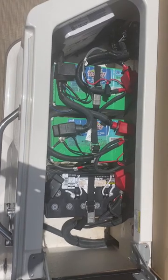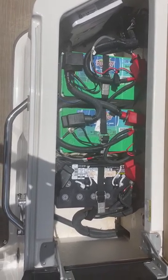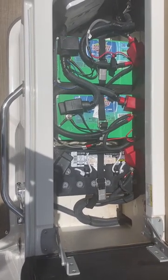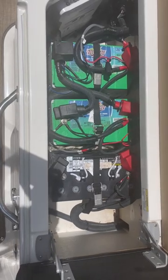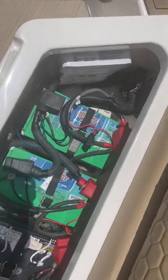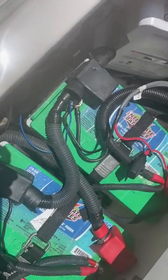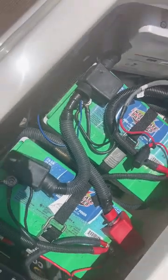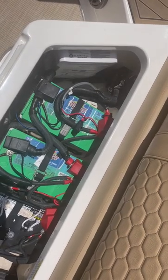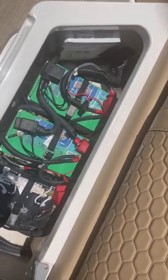Battery compartment. As you can see, there are three batteries: the starting battery for each engine and then the house battery, which controls everything else — the stereo system, the lights, the whole works. Also in here is the battery charger — it is a Nautique 30 amp, 12 volt battery charger. It charges like a triple charger when it's used.